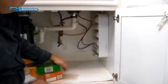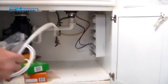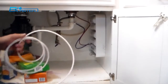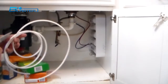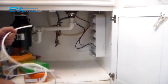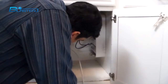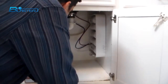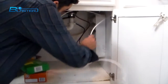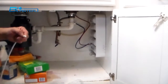We're now mounted. All we've got to do is replace the face and connect the water lines. We're going to connect the water supply line to the inlet filter, and connect the drinking water tap to the outlet filter. We'll also put a ball valve on the included drain in case we ever want to drain this out before changing the filters. This is the connection for the supply — the inlet — so we're going to connect those. I'm going to use a slightly longer piece of hose to keep it out of the way of items stored under the sink; I can always trim it shorter if needed.